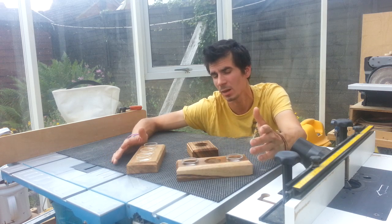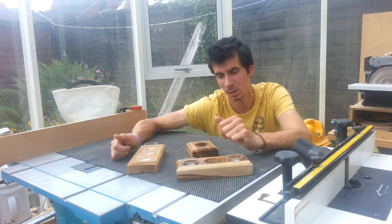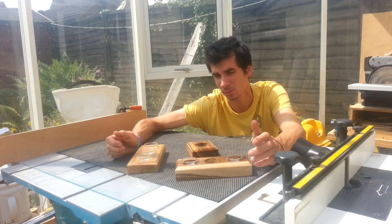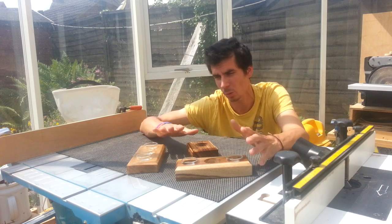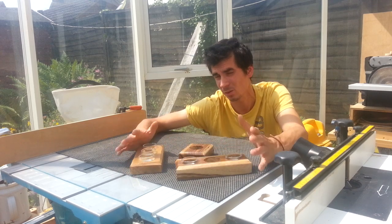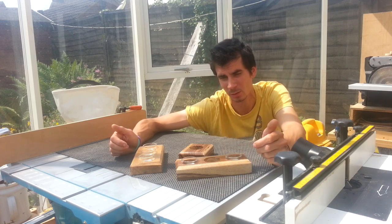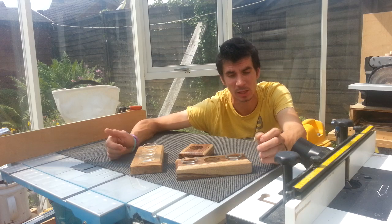The possibilities for this project really are endless. I used the table saw to cut the pieces, but if you've only got a hand saw you can use that, and even if you don't have a saw, go down to your local timber supplier and have a look through their scrap bin — they're normally very receptive. Just throw them a few quid and they'll let you take the scraps. It doesn't matter what type of timber it is — I've made some in Zebrano and obviously the pine. The only crucial thing is getting the hole matched up to the size of the tea light. You could also make the hole slightly shallower and just use the aluminium trays that the tea lights come in.